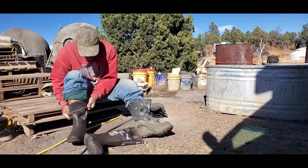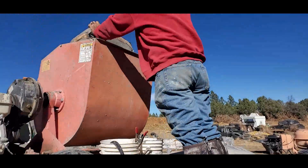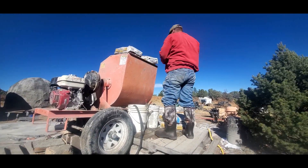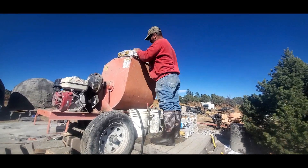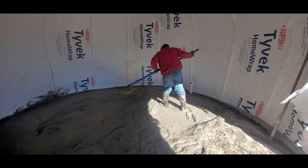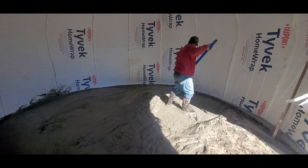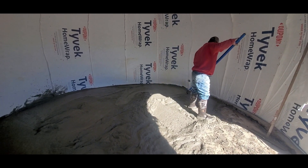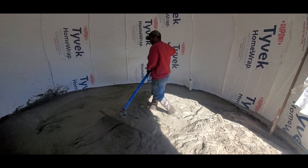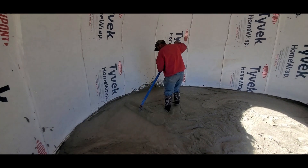What's up everybody, this is Air Creed Harry and today's video is going to be a quick update on my slab for my dome. For this mix I added sand to my cement and 40 gallons of foam. This air creed that I'm moving around here with my bull float had a much heavier, denser, creamier mix than the normal air creed I make with no sand.